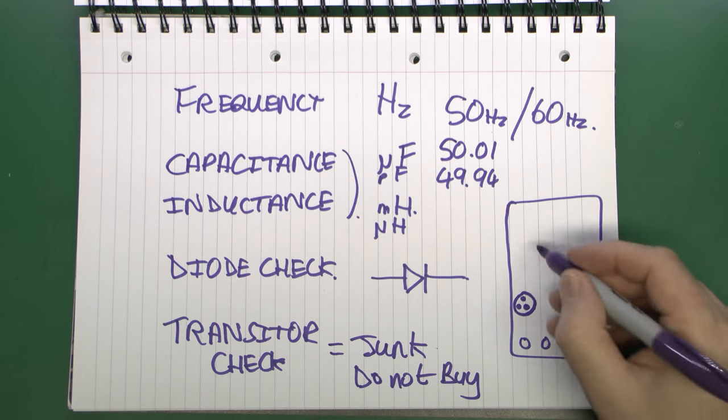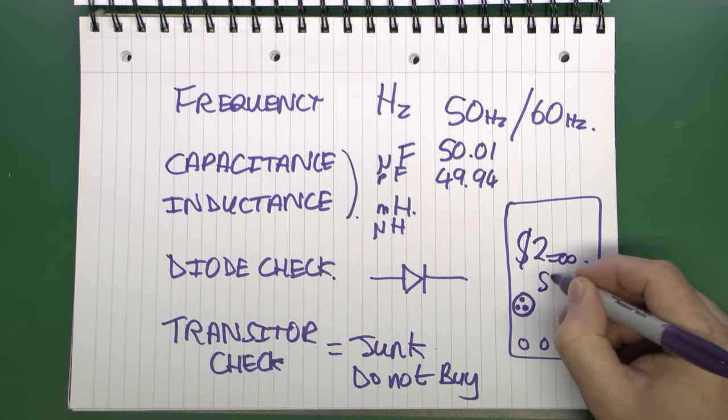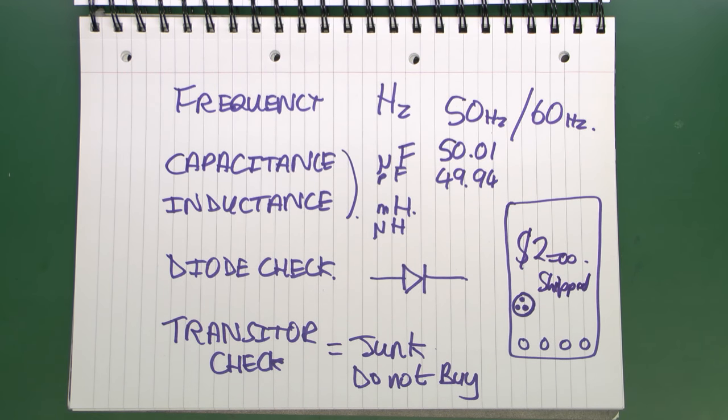These cheap ones are typically found on eBay for about $2 including shipping — basically giving it away for free. So that's multimeters. Bearing in mind that for electrical circuits — things in your house or similar — it is only the most basic functions you actually need. All those other things usually included are not required; some may be useful for electronics, but for mains voltage work, things like capacitance, diode checking and so on are rarely if ever used. If you're buying one to use on mains voltage, it's important it is appropriately rated — if you make a mistake or there's a surge, you want it to remain in one piece and not set on fire or explode. In future videos we'll have a look at actually using a multimeter to test things in a property. Until next time, thanks for watching.